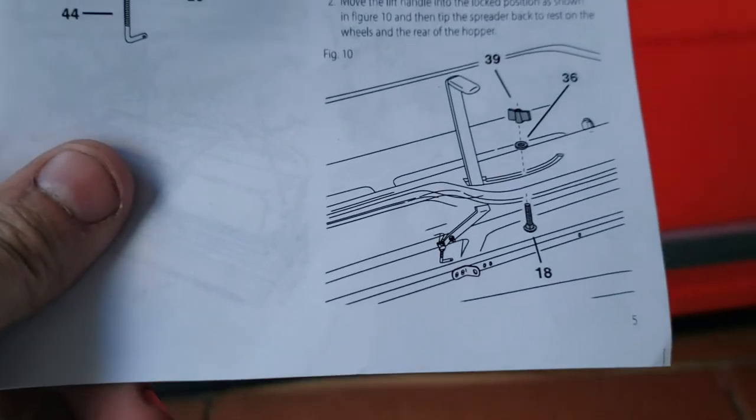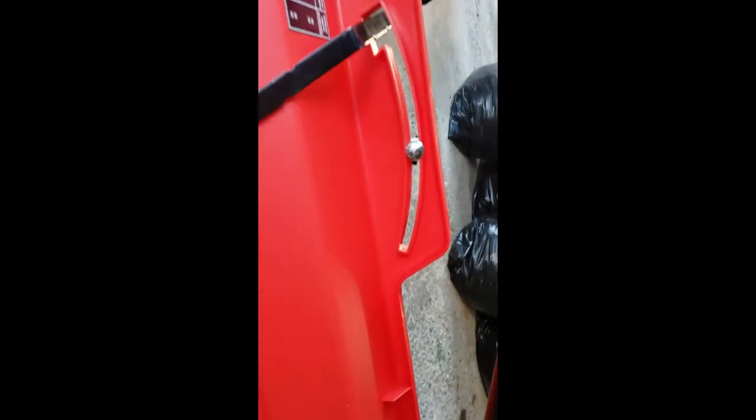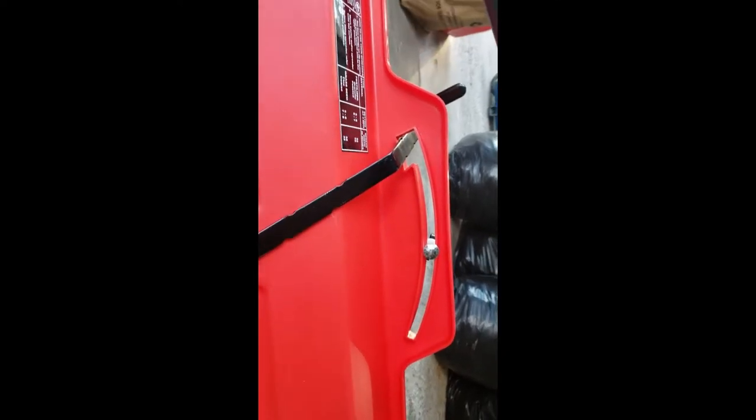Next step. Look at that. Well, I guess we'll throw that together. Yeah, this could use another washer, but it doesn't say use one, because when you tighten this down, it wants to slide past the inside of this instead of grabbing onto it if they were squeezed together. Like this would be squeezed together, and now it rides the little pieces right on that. But it only says to use one nylock washer on the top, and it's a carriage bolt too. So when you're tightening this down, you might want to squeeze this together so it actually pinches the plastic on both sides, or maybe get some kind of washer to help pinch that. We'll see how it works down the road.